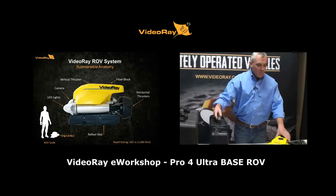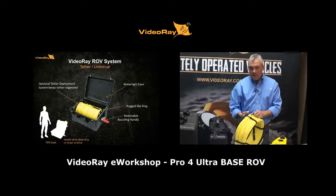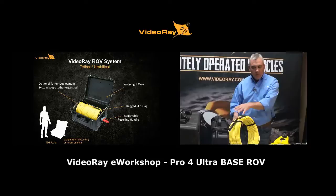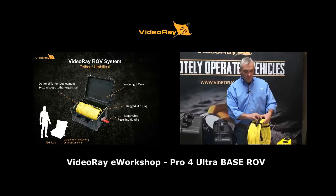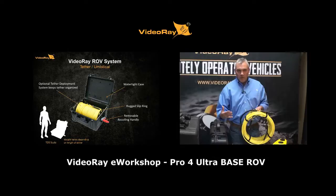The second component is the tether, which connects the ROV to the control panel. It has a very thin diameter and houses the conductors that deliver power to the sub and live video back to the surface. On screen you can see a tether management system, which keeps the tether neat, though some people carry it loose or in a backpack. We can get up to a thousand feet of tether, matching the submersible's depth rating of 300 meters.